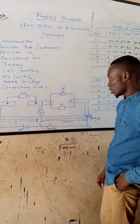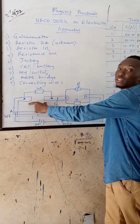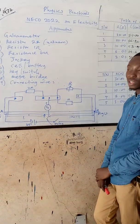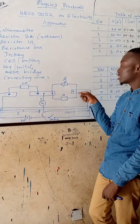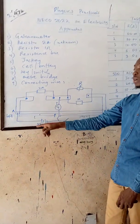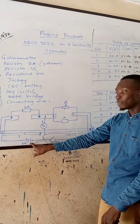This is the circuit diagram I got containing the apparatus we were given. My 2 ohm resistor is connected at the left-hand side of the meter bridge. On the right-hand side of the meter bridge, my resistance box is connected in parallel with the 1 ohm resistor. On the left-hand side also, I connected it to my battery, which is a 3 volt supply battery.